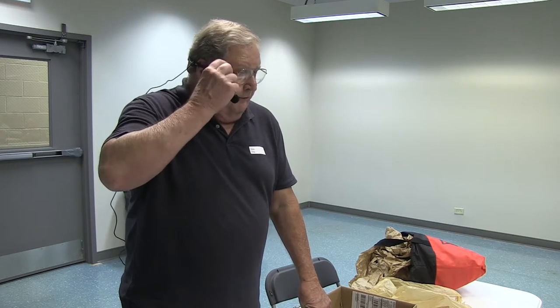There's a rule of thumb that the gun stock makers use, and it would pertain to this very well. Coat once a day for a week. Coat once a week for a month. Coat once a month for a year. And then once a year after that. That's what basically the gun stock makers go by, or what they used to. I'm sure they've got stuff today that's totally different than what we have. However much you want to build up on there, that's up to you after that point.